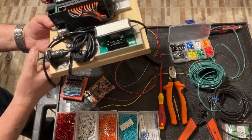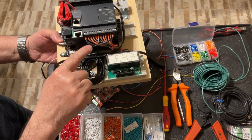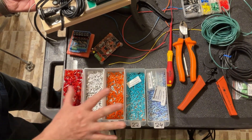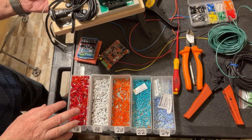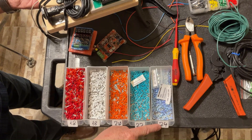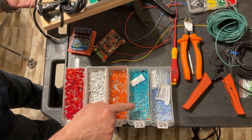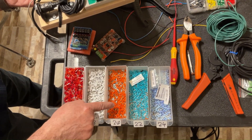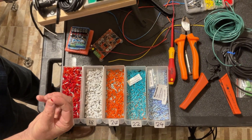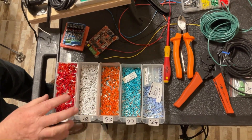Please notice that there is not necessarily a correspondence between the color of the plastic jacket and the color of the plastic insulation of the wire. As you can see here in the boxes, this is the American system organized in American Wire Gauges, AWG. The very small ones — gauge 24 — are a kind of bluish color; 22 is a greenish color; 20 is orange; 18 is white. The color of the ferrules is to recognize their thickness.